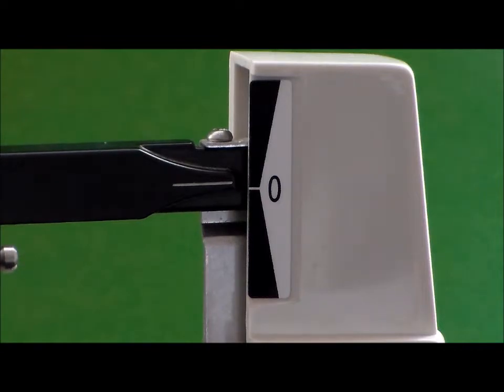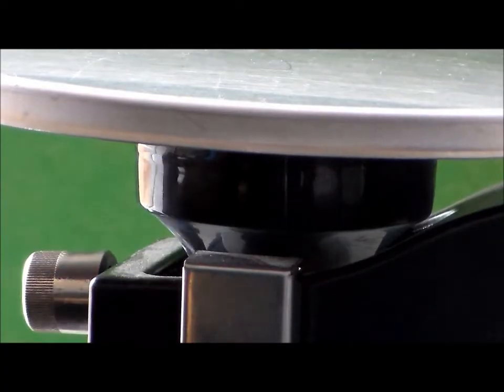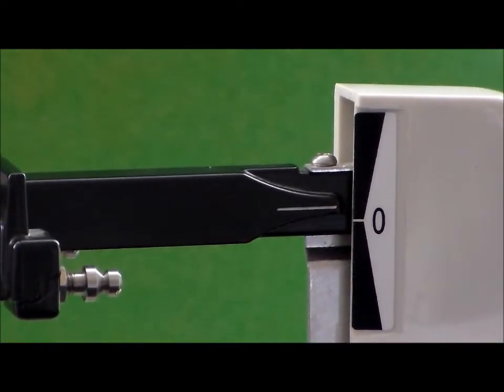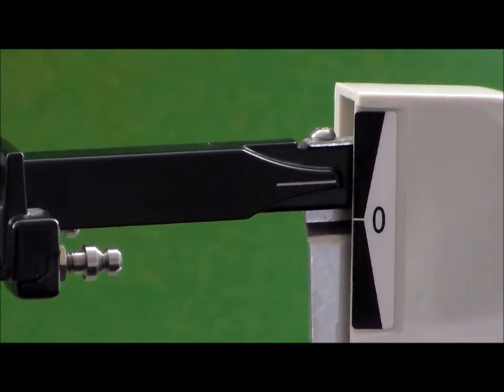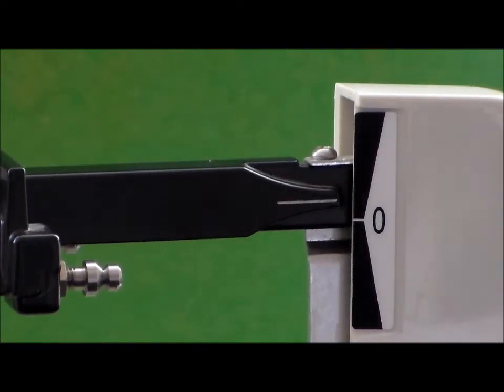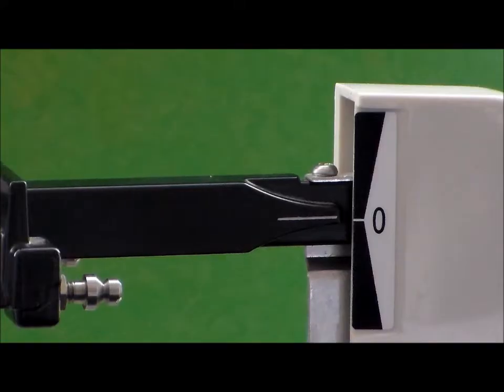As you can see here, it's slightly off. In order to adjust that, you go over to the left side where the knob is and turn it in order to adjust it. I'm going to go ahead and adjust it just a little bit and see if we can get this to balance out. That appears to have made it worse, so I'm going to turn the adjustment knob in the opposite direction. We're just going to wait for that to settle down. That seems to be better. So at this point, we can say that our triple beam balance has been calibrated.